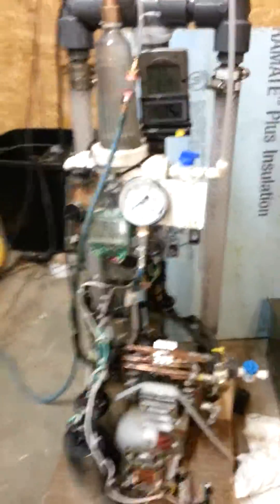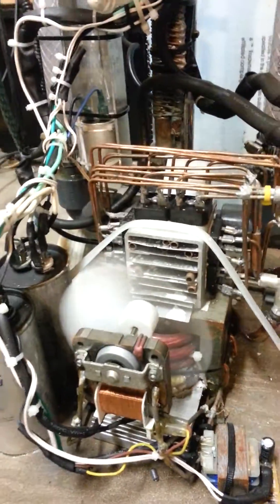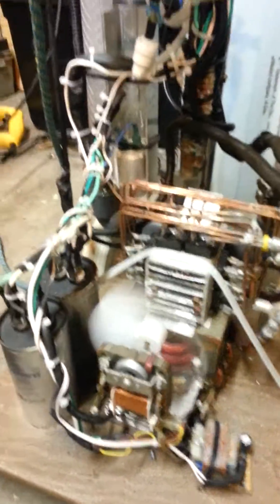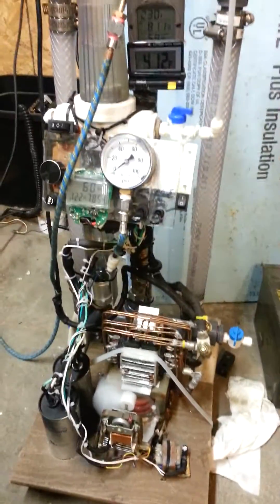I wanted to archive it first. This was just kind of an experiment and did not go too well. The transformer did work okay, it just needs an inductor or a DC capacitor on it. It has a lousy power factor — we're talking about 0.4 at best. So that's the end of that, tearing it apart.